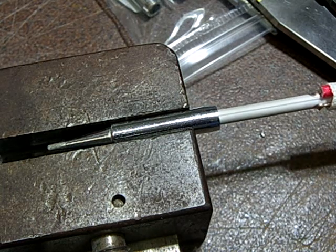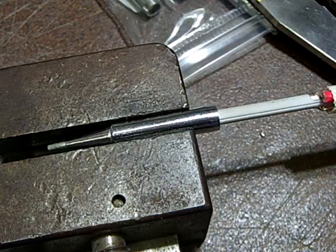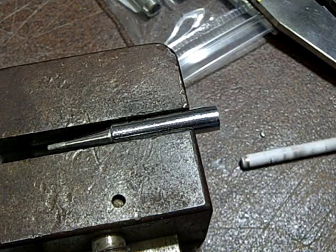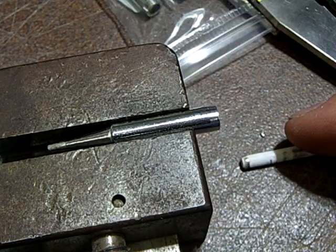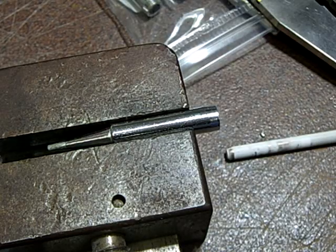There's around a 0.15 millimeter gap all around, and this gap is filled with air naturally. So you don't get a very good thermal transfer of the heat from the heater element to the soldering tip. This means the heater element will get hot and the soldering station will show you that it actually reached operating temperature, but this is only for the heater element — the tip stays cooler.